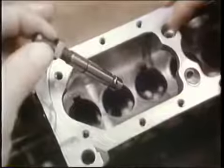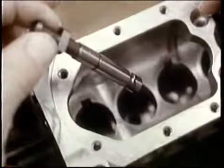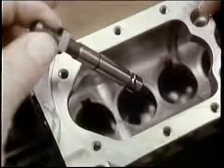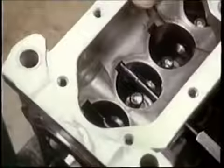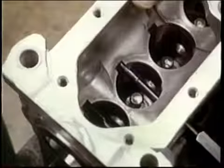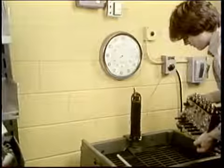For the leak test, install just the plungers. Carefully introduce the tip of each oiled plunger to its mated barrel. And insert these holders to retain the plungers for the test. At the testing tank, you'll need a supply of compressed air.